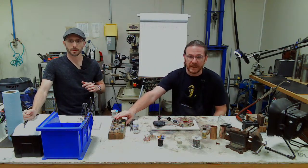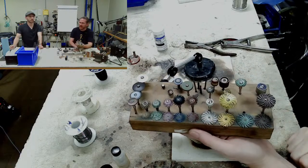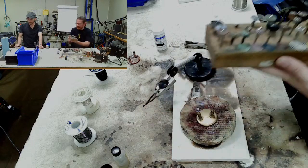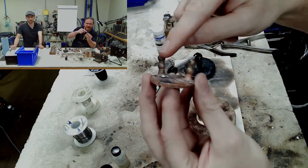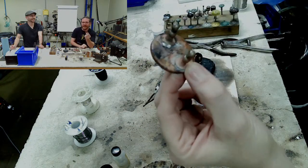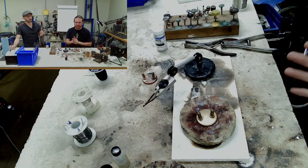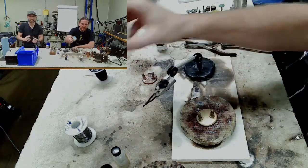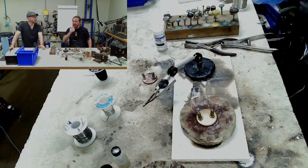I'll cover a lot of prep tools that I really love using — the bristle discs, which come in a variety of different grits — and silicone polishing wheels. I'll basically give tips for making nice clean solder joints. We don't want what I call 'solder sculptures.' You can see a nice clean solder joint on the right and a not-so-clean one on the left. I also put together charts on different types of solder, their melting temperatures, working temperatures, and whether lead-based or lead-free.